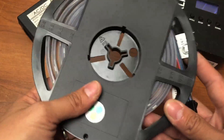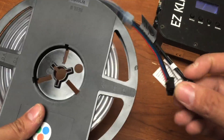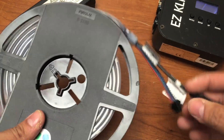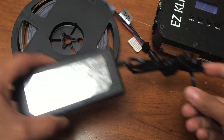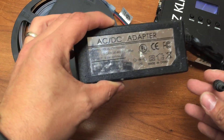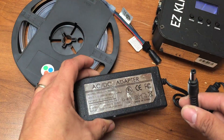Each Pixel Tape comes in a 10-foot spool and you have your connectors for in and out as well as a power supply connector. Speaking of power supplies, this is exactly what you need — a 5-volt 5-amp supply. This is not a 12-volt pixel tape, it is 5-volt.